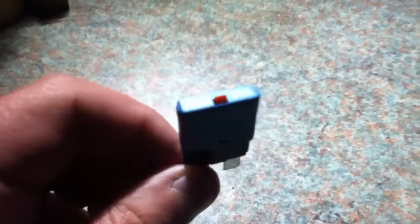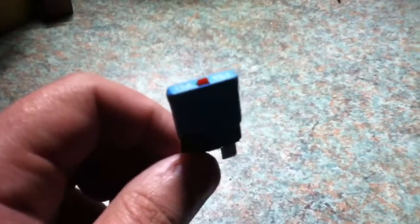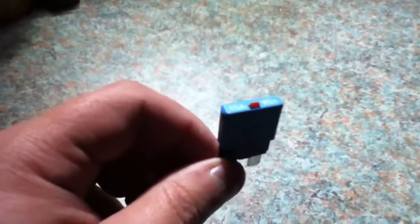So this would discourage you from doing a temporary repair with a fuse of a higher rating just to get by, and the biggest problem with this is you get by and you never get around to replacing it, and that's where the risk of potential overload in the future arises from. So it's best recommended to use circuit breakers, because if you have any problem, you just go and resolve the cause of the problem and you can reset it and your circuit is protected again.